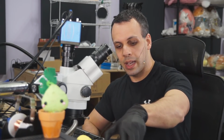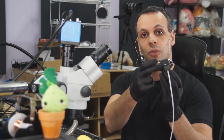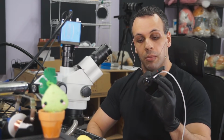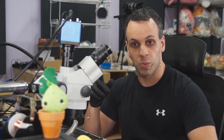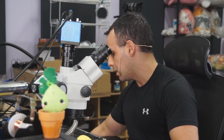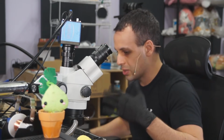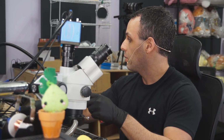Oh, the 360 camera. So I had the shutter speed set to auto. So first thing I did is I got some replacement lens covers for it, so that hopefully it doesn't look shitty anymore. But the next thing I'm going to do is up the max ISO, so that if it's dark outside, it'll deal with that. But I'm going to up the shutter speed. So the shutter speed will be 1 out of 60 or 1 out of 120 constant even at night, which means the ISO will have to be pretty high, so it may be grainy video, but at least it's not going to have that stuff where it's all blurred and slow and discombobulated anymore. We'll see if that works.